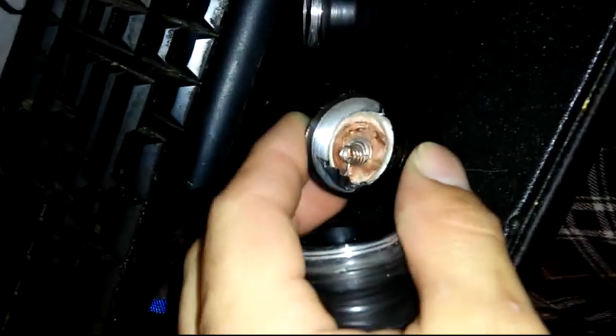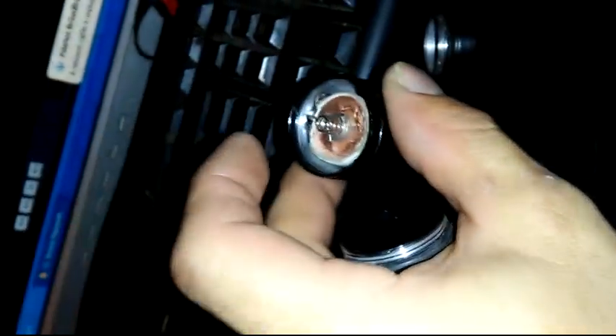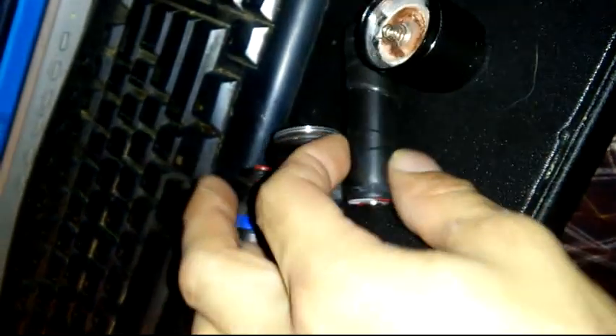There are four pennies down there where the emitter on its little cheap heat sink is sitting on glue. The spring is down there. One emitter lead is touching the case, which hits the negative. The positive lead is touching the spring. Essentially it's very simple — just making contact from the battery to the emitter through the switch.